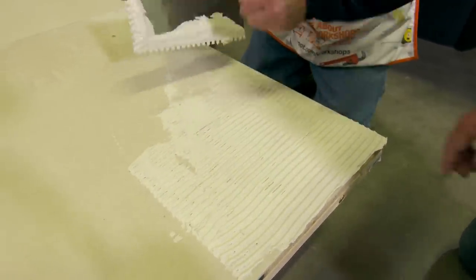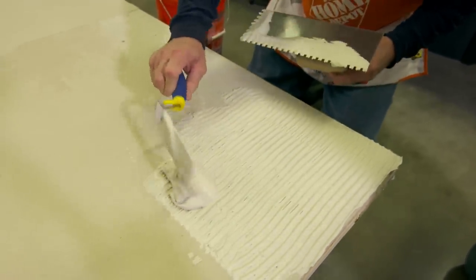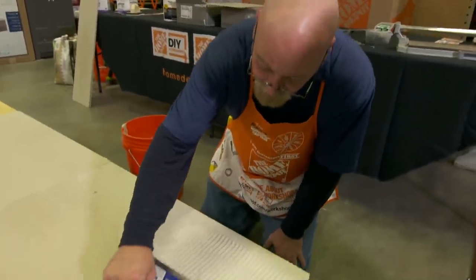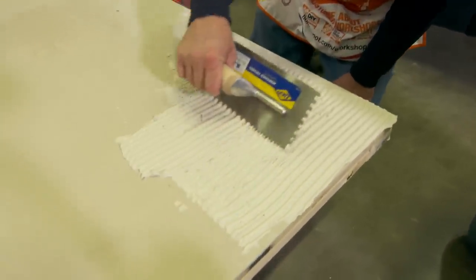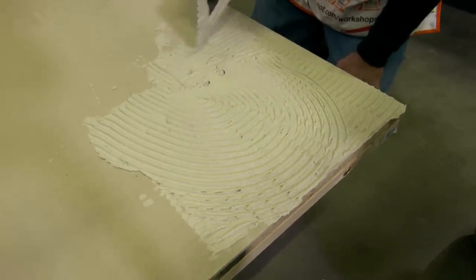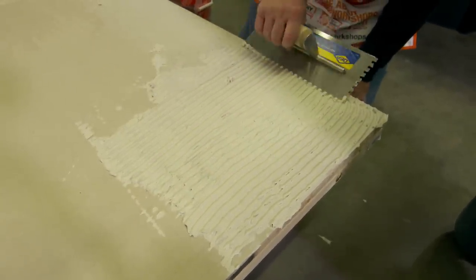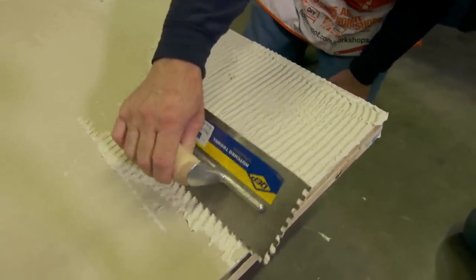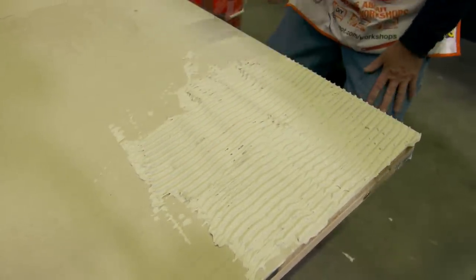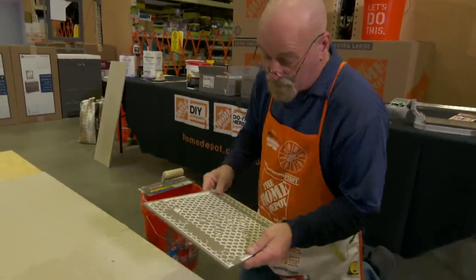You want to have your lines but don't scrape straight down — fill it in. What you're going to do is pull towards you. A lot of videos show doing squiggles, but when you do squiggles you get peaks and bumps and won't have a good set. Pull towards you and get right to the edge.